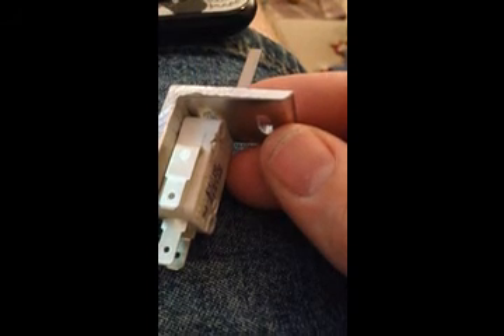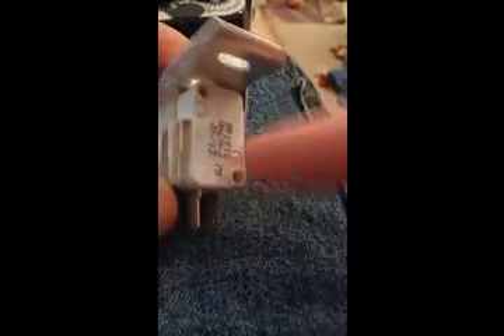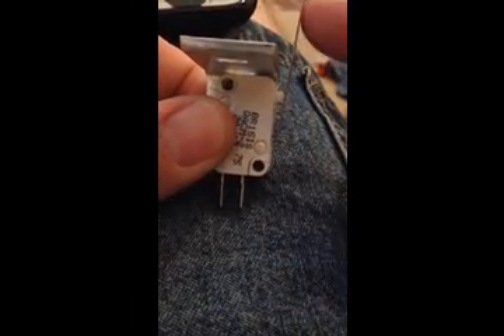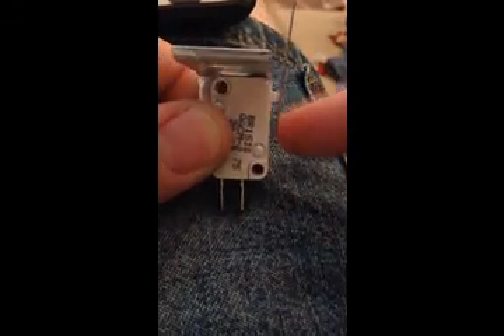I think they're in Ohio, so I might get that material tomorrow. Basically, this is just an angle — switch is mounted from the back, and I've got slots on top, which is kind of nice, because once I mount this to the playfield, if the switch is too far forward or back, I can adjust back and forth and get it tweaked in. This is behind a rubber, so you just barely touch it and it activates instead of having to slam it.